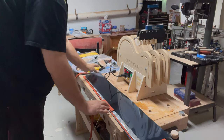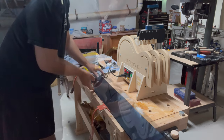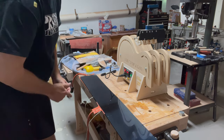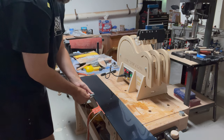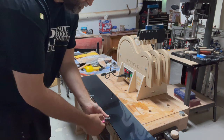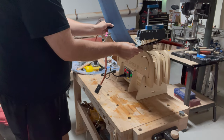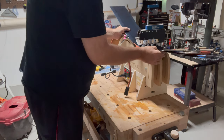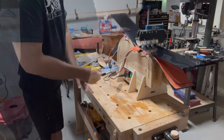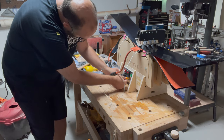I put the last piece of spring steel on and then there are a couple of clips I got from the dollar store that I used to hold the sandwich together as I put it into the jig. Now I'm ready to slide it into the jig. I first line up the midpoint with the waist of the mold and then I'm going to start plugging in the first thermocouple.